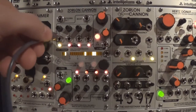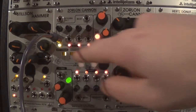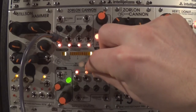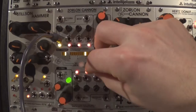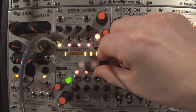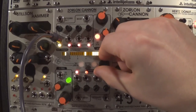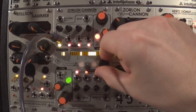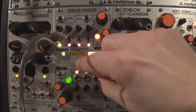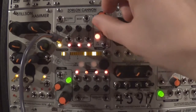In the editing section, each of the 8 outputs can have a different configuration. To edit, hold down the output select button and turn the rotary encoder until the desired output is illuminated with a green LED. Turn the encoder to define the length of the register, visually represented on the display. Then press the tap length button and continue turning the encoder to select the feedback tap configuration. These parameters determine the period of the pseudo-random sequences.